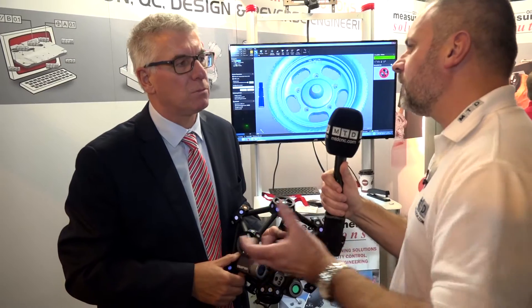And when you're taking the data, is it a quicker system that Creaform have? Yeah, much quicker, because what you find with scanning is they create massive point clouds, so you end up with millions of points and then you have to do something with that. What Creaform have done with their software, VX Elements, is really clever. They've enabled the software to automatically generate an STL or a triangulated surface. So we cut out the middleman — we go straight to a surface. That means the processing time can be reduced from days to minutes.